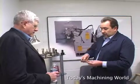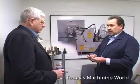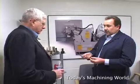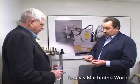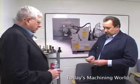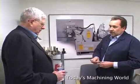After that, you have to decide what's quicker to do. Is it quicker to put it on some type of screw machine, a Swiss or something, and turn it out, or is it quicker to just grind it? What a lot of people find, depending on the material, is the tooling charges are cheaper on a grinder because the wheel lasts a long time. It's a $500 wheel, and you can probably make 500,000 parts with it, or maybe more. So it just really depends on the customer.